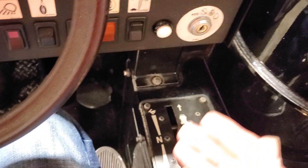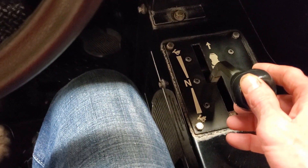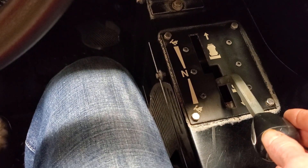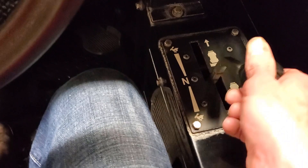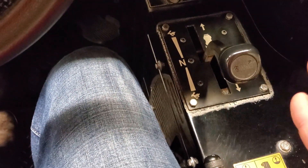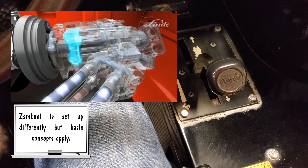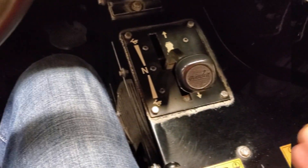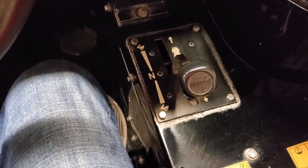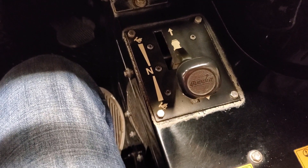Let's talk about the transmission control lever. This lever controls direction of travel — either forward or reverse — and machine speed is also controlled by how far from neutral this lever is set. The further you go from neutral in either direction, the faster and more powerful the machine is going to be. When you move this lever back and forth, you're actually moving a swash plate and pistons inside a cylinder — that's where the hydrostatic comes in. A hydrostatic transmission is a fluid power transmission with infinite variable control that's independent of engine speed.